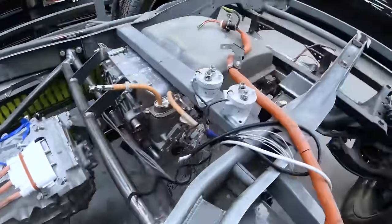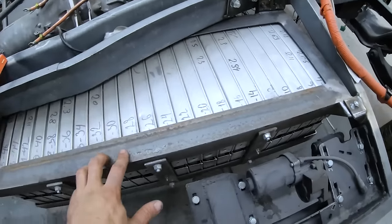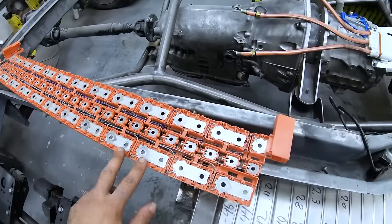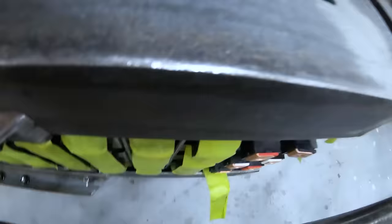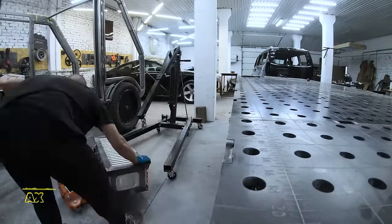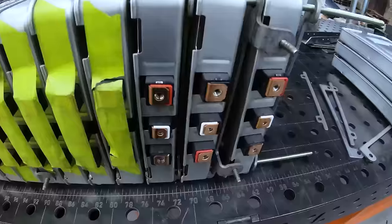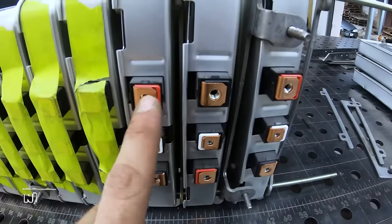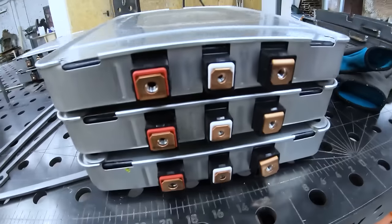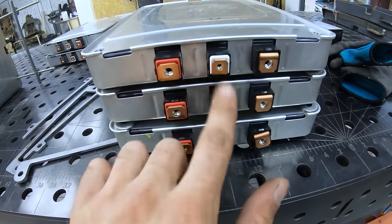We did the minimum wiring with the wires we received, and realized what we needed to expand and buy. We should remove the battery pack and swap the batteries, since I assembled them for the native connection cassette where they're connected in staggered order. We need to reassemble them so we can use one rail to line it all up. By this point we decided to use a different commutation method - much simpler and more reliable. Previously they were assembled in a triangle pattern; now they should be in even strips so we can just make a copper rail with holes and connect it all together.